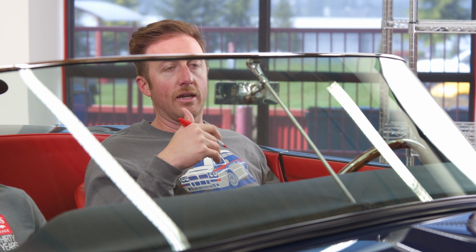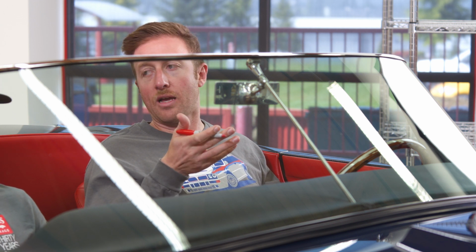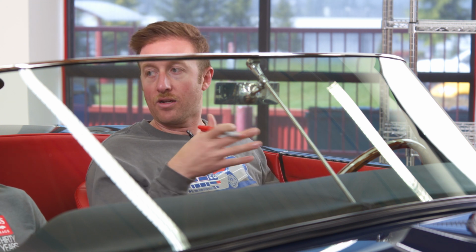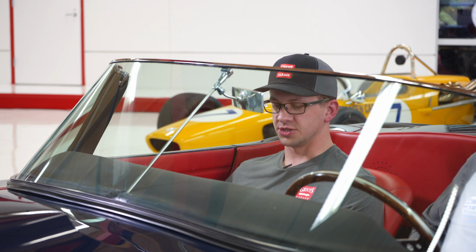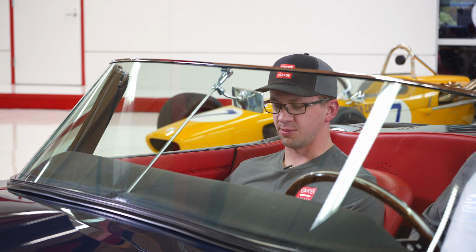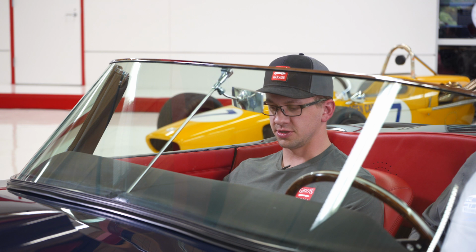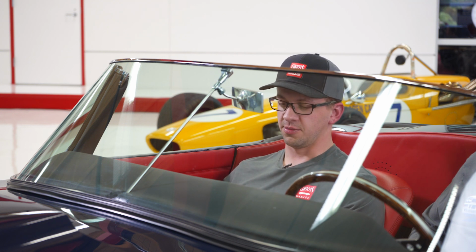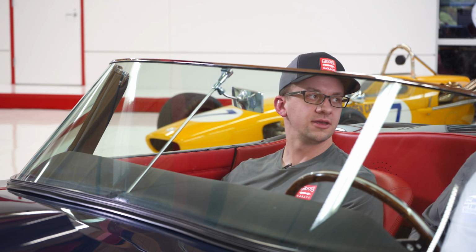The one thing I have found with stainless is that you don't really want to do any abrasives. I have used one-step sealant on it. Yeah. It doesn't necessarily change the grain if you've got a grain to it, but you definitely can put a pure protectant on it after you get it really clean. Yeah, sometimes polishing it, it'll almost brighten it, and occasionally it's inconsistent depending on what your process is. I know I've seen that before. So just test if you're gonna polish. Like our heavy duty metal polish is a good solution for stainless, but if you're doing it by hand, I know going with the grain will prevent any inconsistencies.